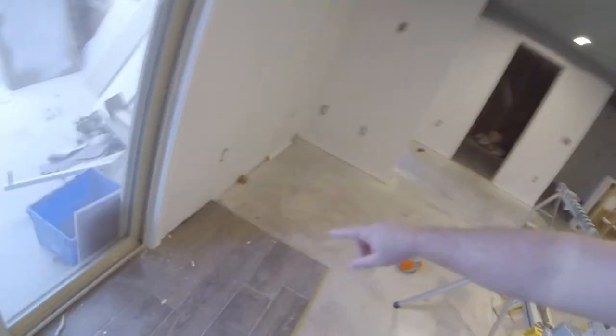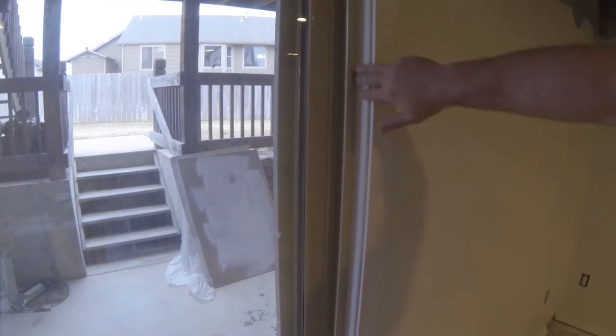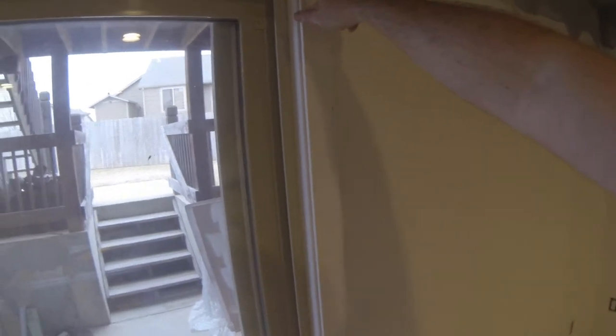Here so I can go ahead and do the rest of the walls. But as you can see, I just took the 16 gauge nailer, nailed my 1 inch poplar in the side here, and then came back with some shims just to close up this gap in the corners. So you won't need too much caulk besides right there in the very corner. And got everything trimmed out.